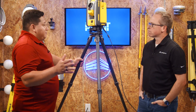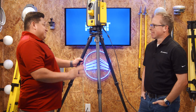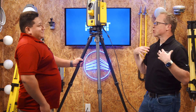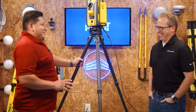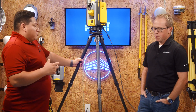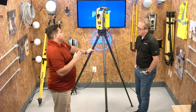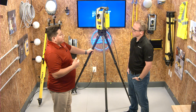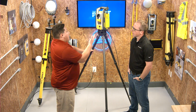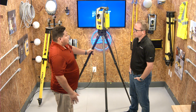You need to have the right tripod for the right piece of equipment. For our robotic total stations, a carbon fiber tripod — the legs are way too thin and way too lightweight. When you turn on your robotic total station, it's going to initialize some of the components inside, and all that vibration is going to be sent down the leg and back up, causing it to start vibrating or humming — and that's only if you're stable on a piece of concrete by yourself.